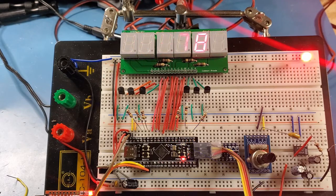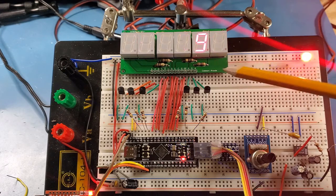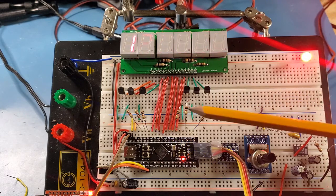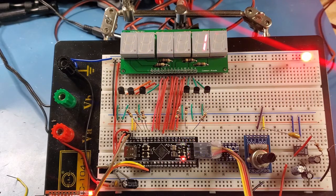Anyway, that should be enough features to have a bit of fun. We'll get to play around with LEDs and how you drive those, we'll get to play around with GPS, and I'll also demonstrate how you drive that using driver ICs — the MAX7219 for example. Using driver ICs is much simpler than what you see here; you just drive it using an SPI-style interface. So let's move straight on now to driving the LEDs.